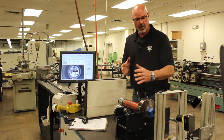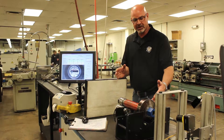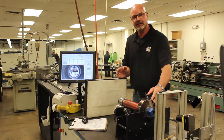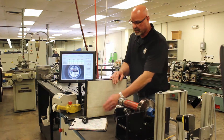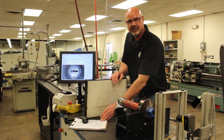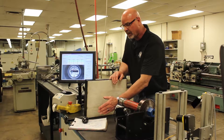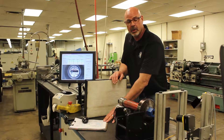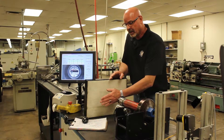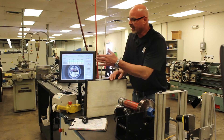The max bolt or SPC4 calibration process is done in a jack assembly here at our facility. Our engineering department puts together the mechanical properties of the fasteners and the requirements to proof load of the bolt. Every bolt is pulled to proof load and the data is recorded in a program.